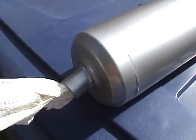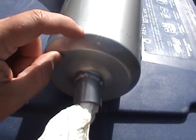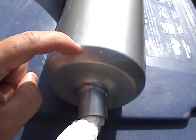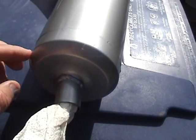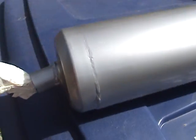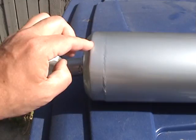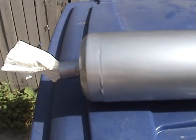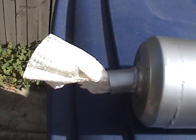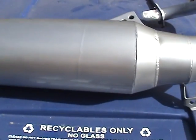I had some problems down here with the paint flaking off — I didn't understand why. I prepped it pretty good. What I did was I sanded it with some 220 on the rough spots; when you sand it like that it gives the smooth steel little ridges for the paint to stick to. So then what I did was I coated it with paint and then I put more clear on it.